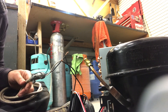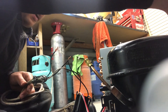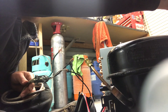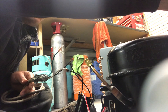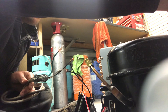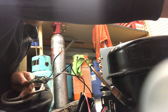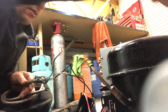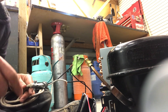I don't know if you guys can hear, but the compressor is running. All I'm going to do is touch my high side to see if the refrigerant is hot. Right now it's a bit cold, but it is getting a bit hotter. The compressor fan is not running right now, so it should get pretty hot. Oh yeah, it's getting hotter. So there is definitely refrigerant in the system. And now I'm going to unplug it.